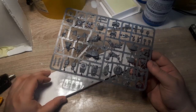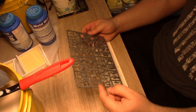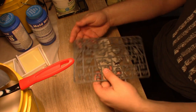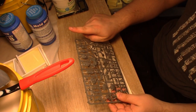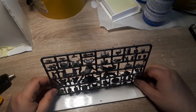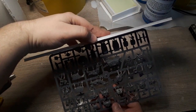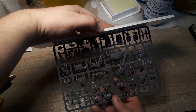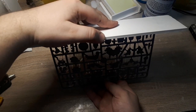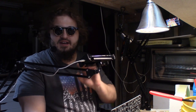Alright, so we once again come up against the crucial juncture, the one that I messed up oh so many times. We have air vents that are supposed to let the air rise and escape the mold. We're going to be mounting it like this, because once we actually super glue it, pour the silicone, and demold it, the vents would have to be pointing upwards. Perfect, okay. This hobby is too damn expensive for me to make the same mistake 5 times.